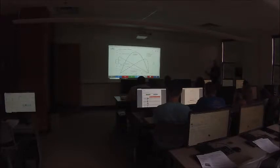Let's say that I hook it up to an engine or something, and I turn it in this same direction. Which side of the motor is going to be positive, and which side is going to be negative? Well, what's going to happen is, I guess I draw it this way. But anyways, current's going to want to come out on this side and go in this side. That makes sense? So basically, if you look, this is the opposite direction the current is moving here. Right? The motor's turning the same direction, but current's going the other way.